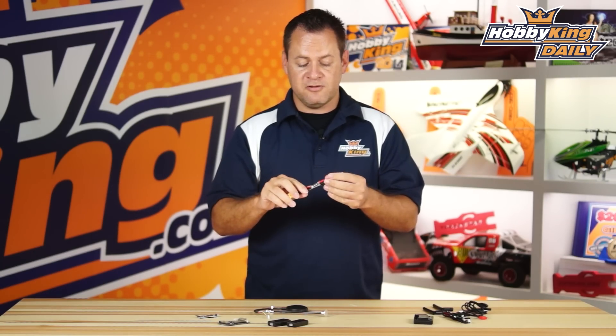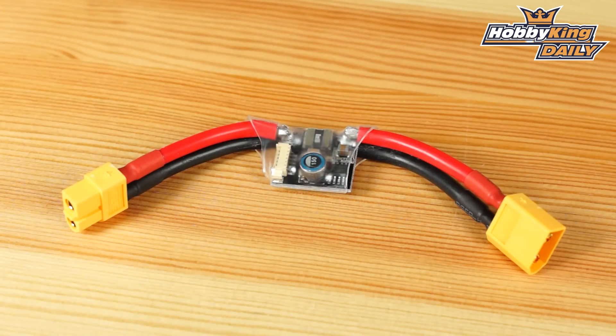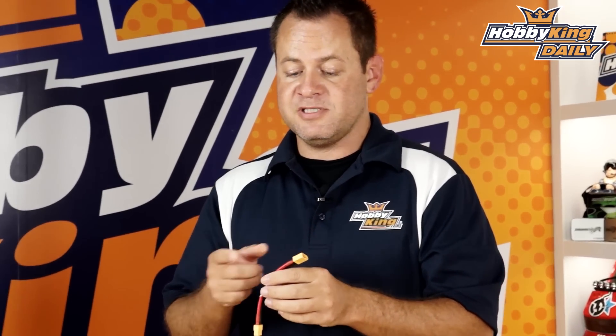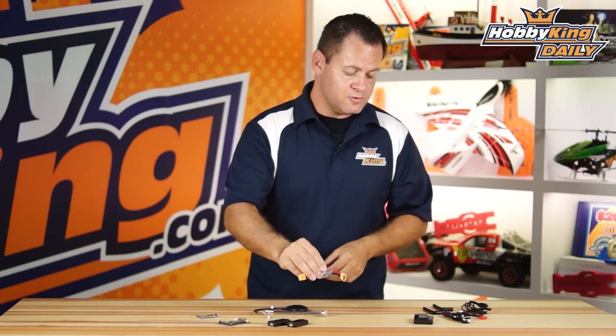Another component that is updated besides the flight controller and the radios is the PSU, or power sensor unit. This provides amperage as well as voltage data back to the flight controller for telemetry feedback, as well as fail-safes and a couple other things, as well as providing voltage for it. What's awesome about this variant, besides the XT60 connectors, is that it's 10S capable. That is part of the Master Set — that's the new style right there.